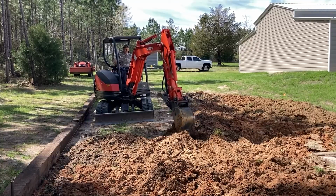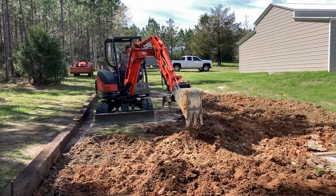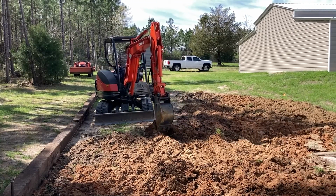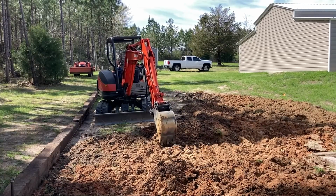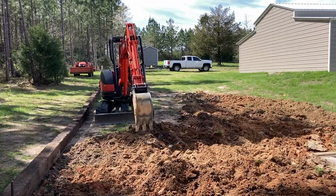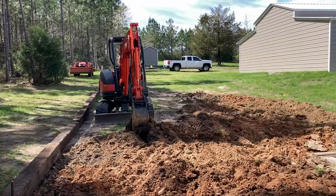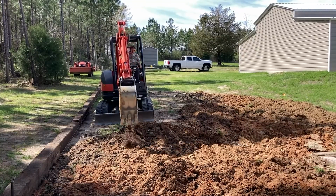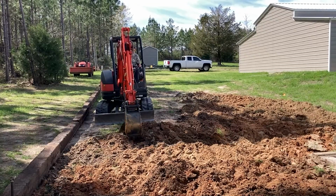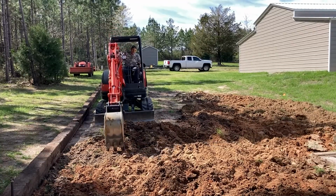I've seen out on the internet or on Facebook groups where people say you shouldn't idle an excavator because it makes the pump work harder. It's wide open throttle is what they say. I don't know, leave a comment down below if you have any experience with excavators, if you've ever owned one or operated one a lot, how you operate it. But I find if I go wide open throttle, I lose a lot of control. I become very jerky with the controls, and I feel like it's better to go at just enough idle to give me power to move the dirt.